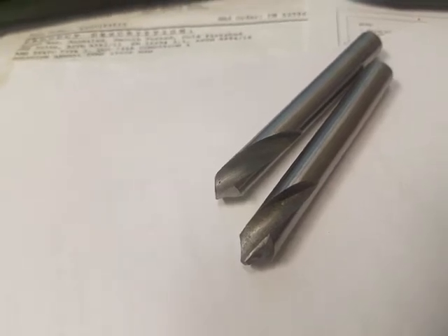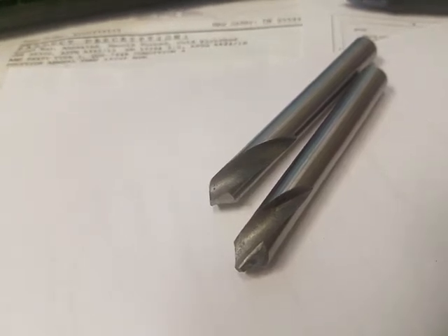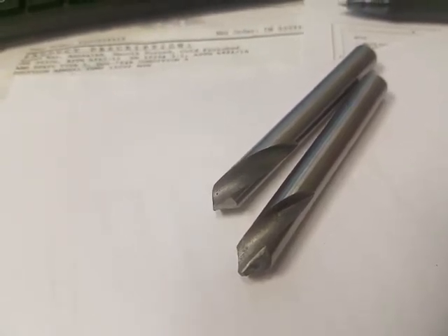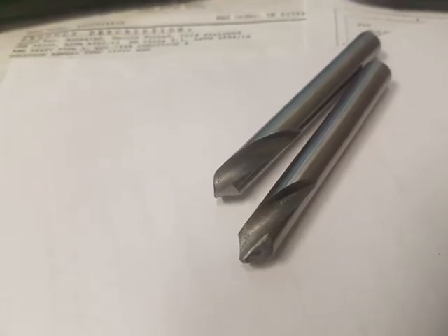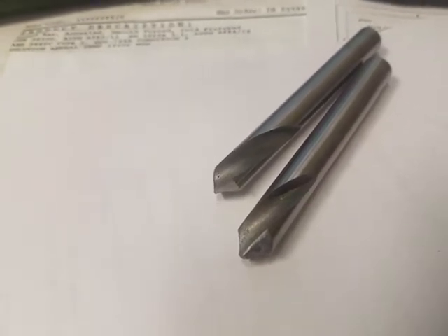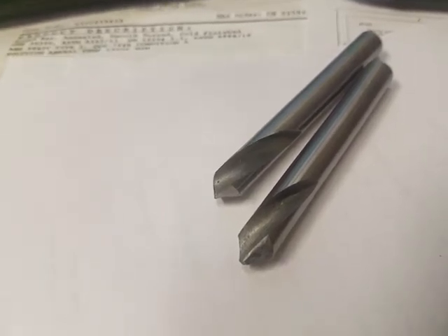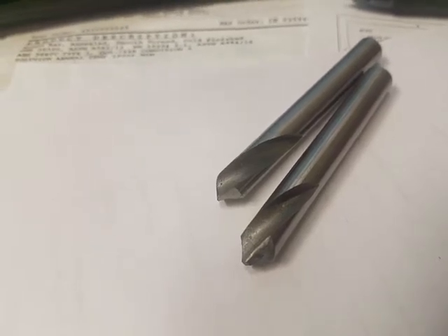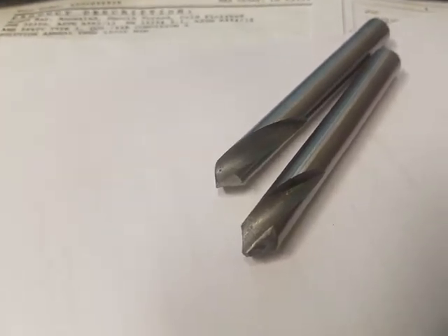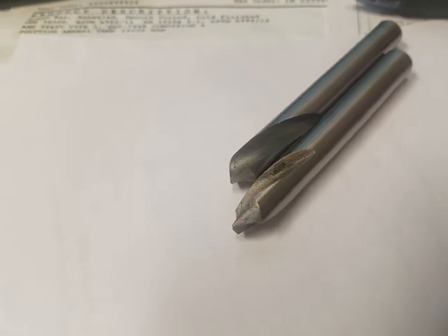If you just can't, I've seen some videos where people are just using picks and needle nose pliers and kind of unwinding it that way. I've done that, but it does kind of thrash the first thread — the lead thread — and you've got to go back and chase it a little bit. It works, but it's a little scary because you don't want to ruin parts. I found that this modified spot drill method is almost a little bit safer to use. Good luck and I hope this helps you out.